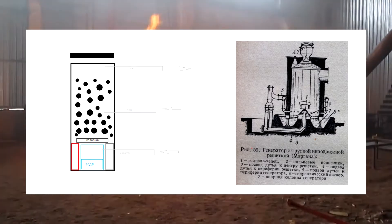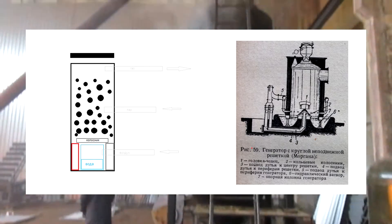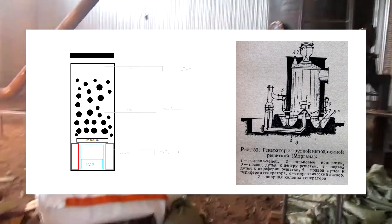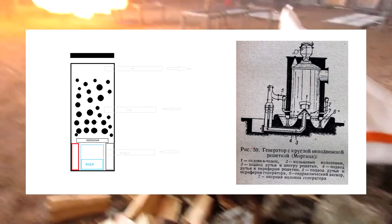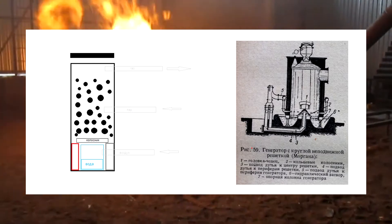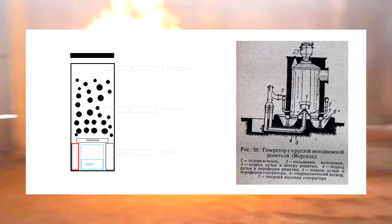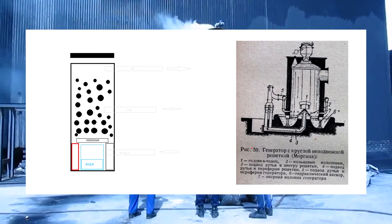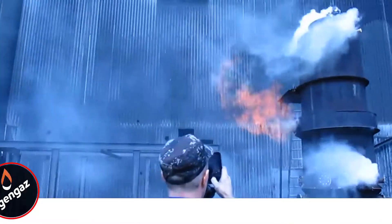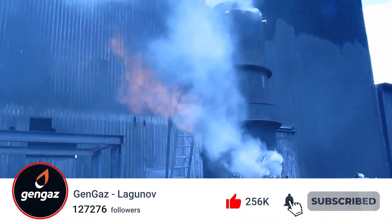The author does not describe how he gets steam, but we can see that the steam is fed into the middle of the shaft while the air is fed under the grate. This is incorrect. The steam should have been fed into the same place as the air. By blowing air under the grate, we get a temperature that can exceed 1,600 degrees, melt any grate, and clog everything with molten ash, which can already sinter at 900 degrees. The grate should have been made perforated and rotating. From what I saw in the video, it was just a cast-iron manhole cover — I think it even had no holes, though it's hard to see.